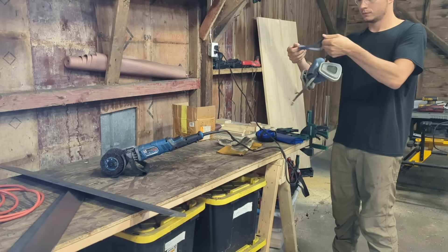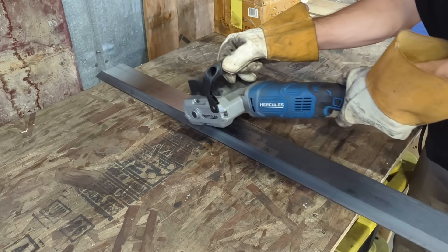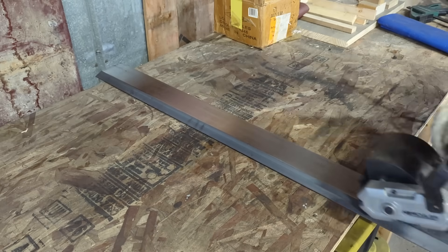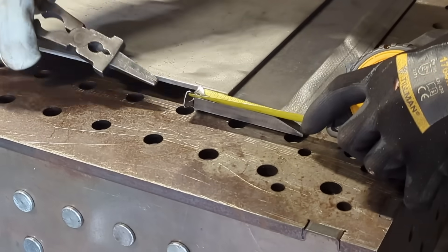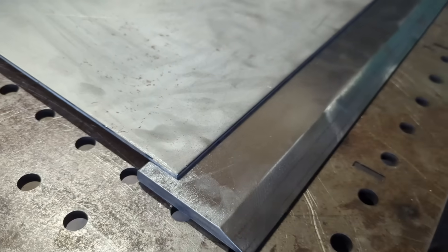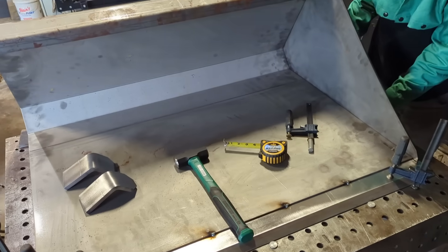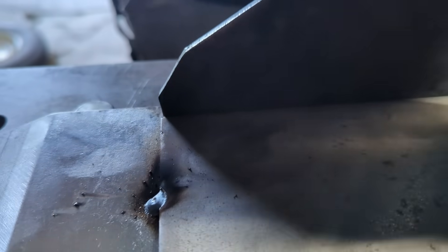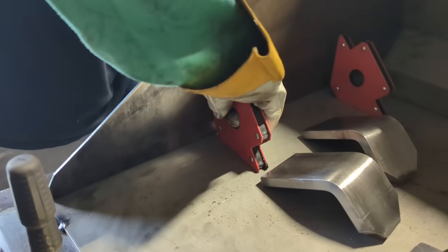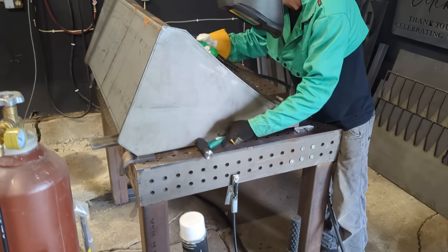About a week later, we jumped right into fabricating the bucket. About seven in the morning, my buddy got here and we got right to work. I'm just hitting this cutting edge material with the Harbor Freight surface conditioner to strip all that mill scale off, because I'm going to be spray painting this with liquid paint. I've heard if you don't remove the mill scale, your paint pretty much just flakes off. We're laying a tack down and then smacking it with a hammer — just allows everything to shrink up really nice. You'd be amazed at the problems you can solve while smacking things with a hammer. Next up, we were putting the side plates on using some standard magnetic squares, lining it up like in the CAD model, and tacking the bottom side to make sure that fitment is tight as well.